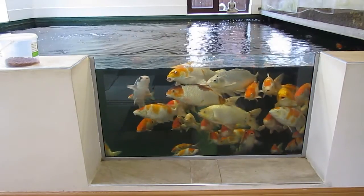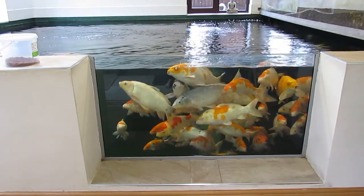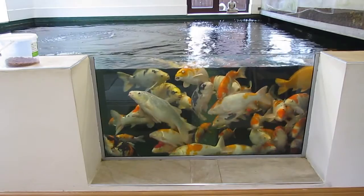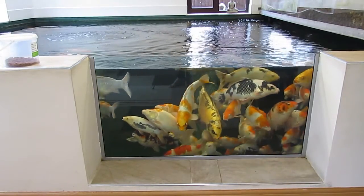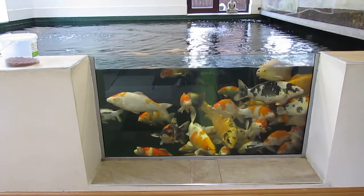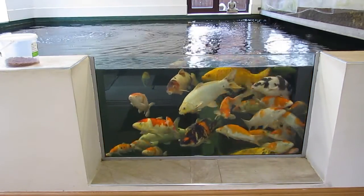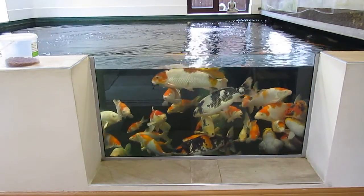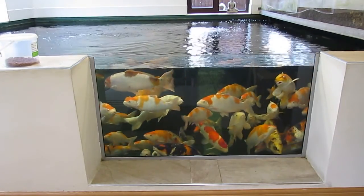But also, if you do a system like that with an air source heat pump or a gas boiler that heats your pond up to high temperatures, then I do recommend that you get an inline heater after that that's set to a couple of degrees lower. The reason is that air source heat pumps don't work past -12 or -15 degrees, depending on the model. I think mine's -15, but I'm not sure.